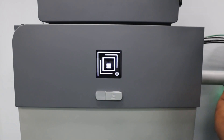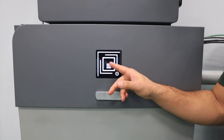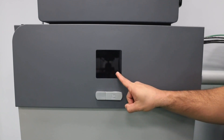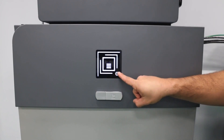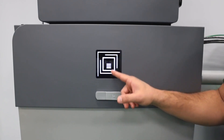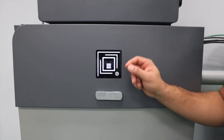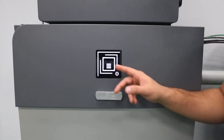The e-Force also comes equipped with LED indicators to show the status of the battery. Each bar symbolizes 25%, so it'll be 25, 50, 75, and then on the fourth bar you will see 95%, and the fifth bar will be 100%. To access this you just need to press the fingerprint button here — it does not need to recognize your finger, it's just a button to show where your finger will be pressed. It also comes with indicator frames to show that the batteries are communicating with each other, and an exterior frame to show if there are any faults or alarms. If you were to have a fault or alarm, you will not see this frame lit up — as you can see right now, the battery is fully functional.